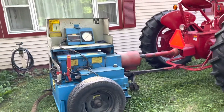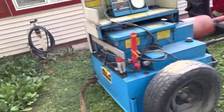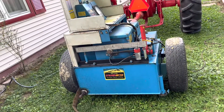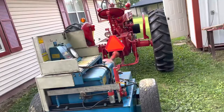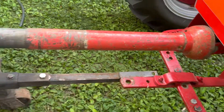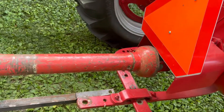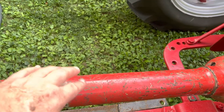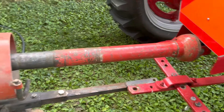I'm going to try to demonstrate how this is set up and how it measures. We'll fire this old tractor up in a minute. What we've got here is a unit that actually measures horsepower — it's a hydraulic brake setup. As you increase the pressure on the brake, it puts a load on the engine through the PTO shaft. PTO is an acronym for power takeoff. Anything that the tractor drives — like a hay baler, a hay bine, a small combine, a bush hog — is driven off this shaft right here. That gives us power directly from the engine, comes back through the transmission and into the dyno.